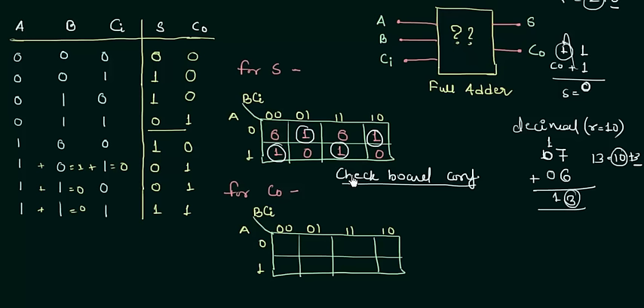So at the end of this presentation, the sum is A XOR B XOR CI and the carry output is AB plus CI(A XOR B). It is easy to implement this as a circuit — you can take a 2-input XOR gate, using two such gates: the first computes A XOR B, and the second takes that result and CI to give A XOR B XOR CI as the sum. You can also use a 3-input XOR gate directly. The carry output can be implemented similarly. In the next presentation we will cover another part of arithmetic circuits.